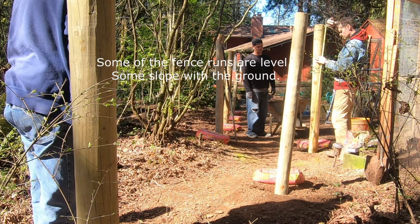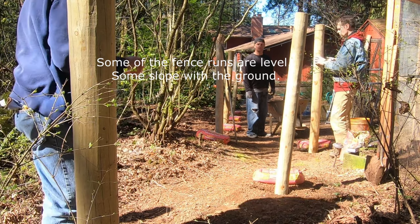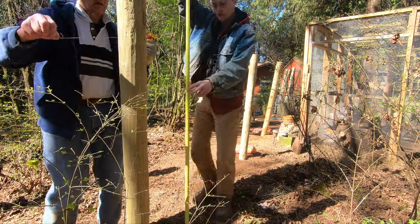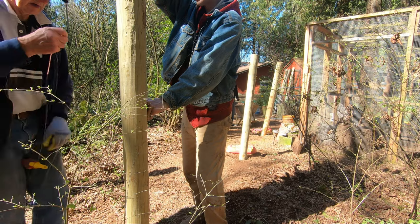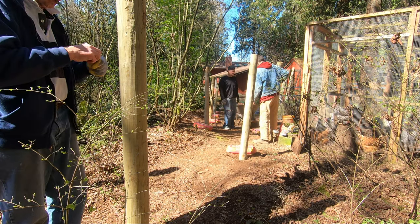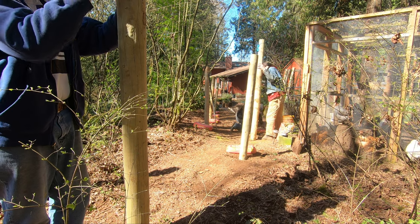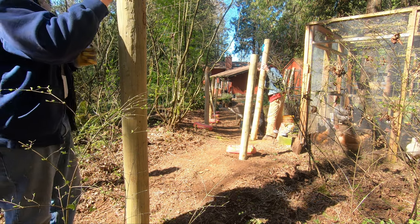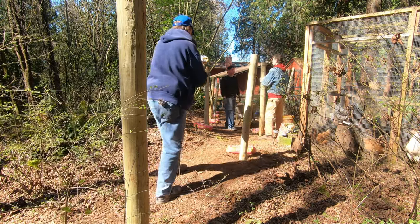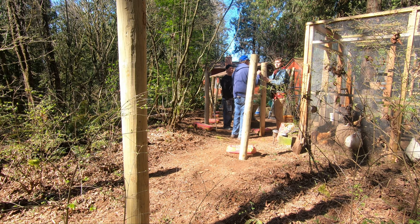And the string level is the best way to do this, but just as a preliminary, this is about 68 and a half inches up. Four and a quarter. So yeah, we did put in too much gravel. Well, start banging it. If nothing else, we can use that clamshell shovel with the post hole there. Are we talking like an inch or two? We'll find out. No, I think if you just tamp that, you're there.